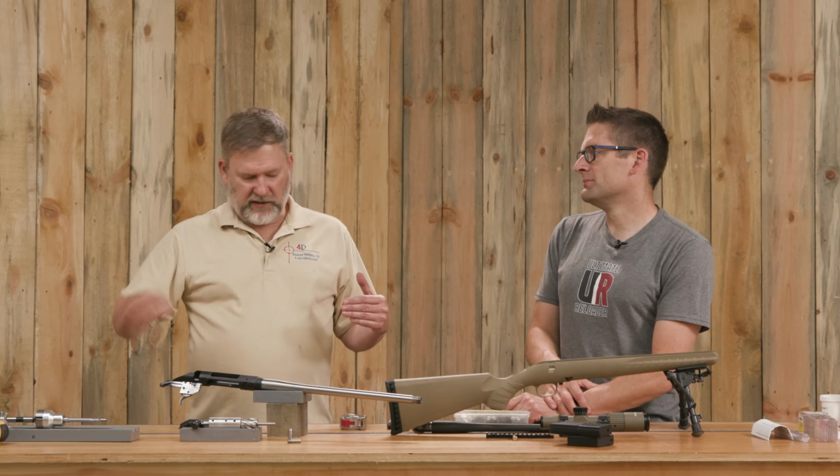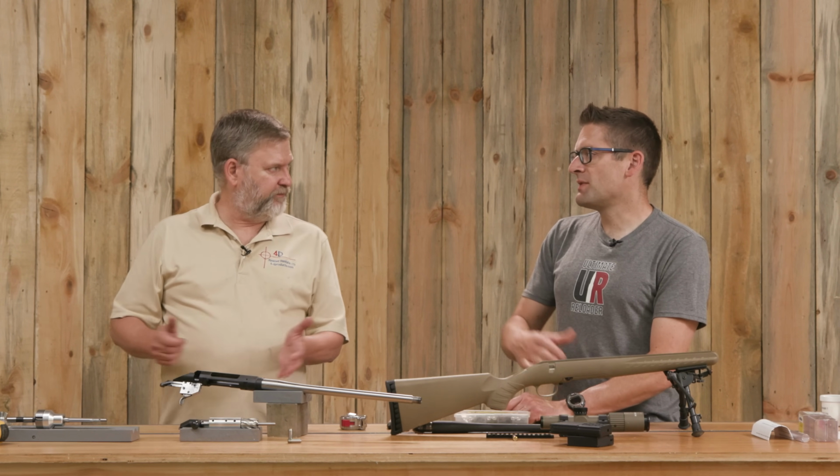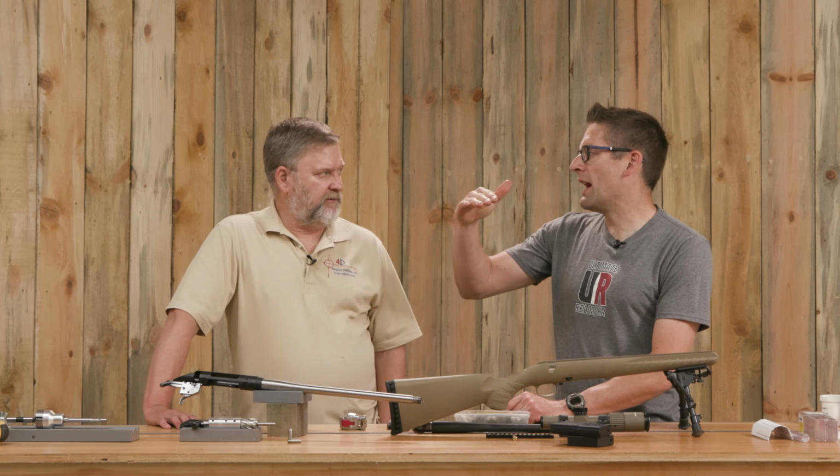But they're not aware that when they tighten that thing down, of course they've seen your stuff about Gordy, they know that there's a torque there and things change. But you'd be surprised how many people just take for granted that the tailstock is solid. Some tailstocks leave the factory high so that as things wear in, they lower down. And if you think about that, when you're turning, that doesn't hurt anything, because you're cutting here on the side. So if there's a little bit of a taper this way, that's not actually going to affect how the lathe cuts. But when you're chambering, that's a different deal because now you're off axis. It'd be like precision drilling where you might run into some slight issues, or reaming.